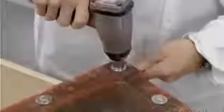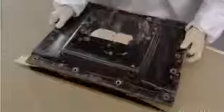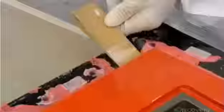They bolt the mold closed and leave the paste to air cure overnight. The next day, they unbolt the mold and extract the shell, the 2 halves of which are now bonded, with the first antenna inside.